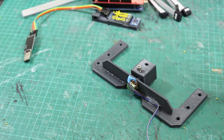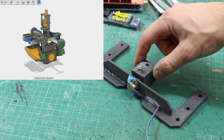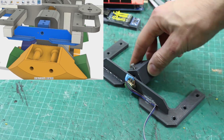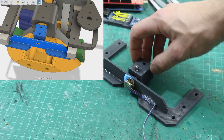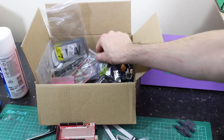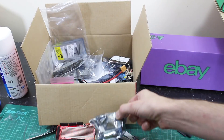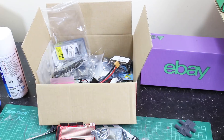We need to measure the rotation of the side-to-side axis, so I've got a pot mounted on a thing that fits on the 2020, and that piece fits on that central axis on the piece of 2020. That'll measure the position so we can basically turn that side-to-side axis into a big servo. I've also got a box of loads of things from eBay — loads of wire, some voltage displays, a spare Arduino, some motor drivers, some nice switches and things — all things we'll pull out as we put the electronics in.